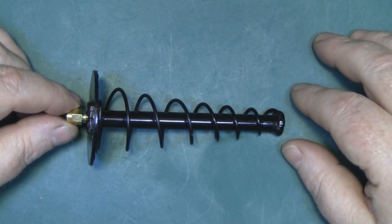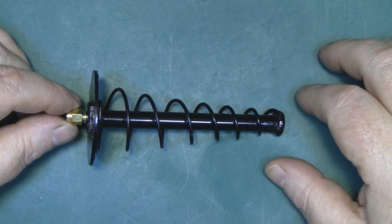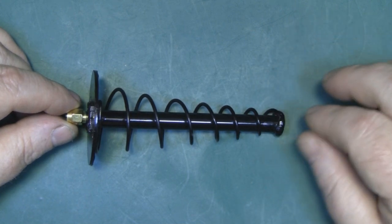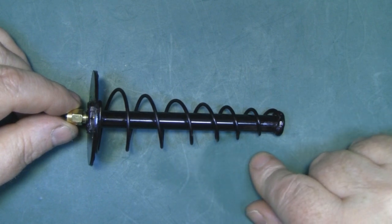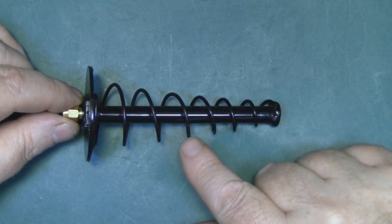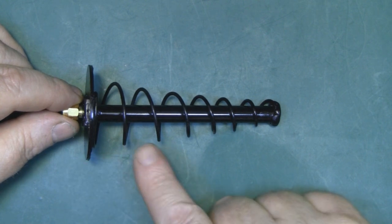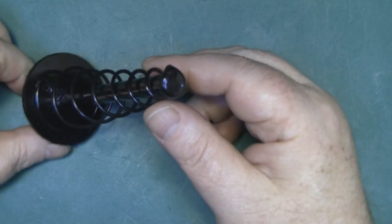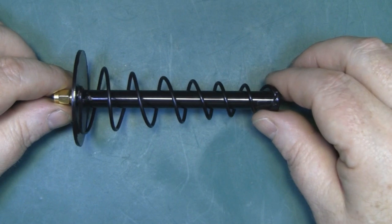If you're looking for a dual band antenna, I wouldn't go down that route — I'd look at something like this which is wide band. Wide band antennas are normally directional; I can't think of any omnidirectional wide band antennas off the top of my head. In this video I'm going to show you how I came up with this design and actually made it. It is quite a simple design — the wire I've used is two millimeter thick garden fence wire.